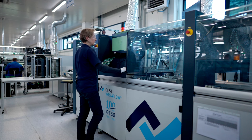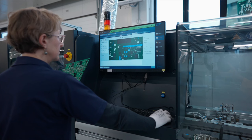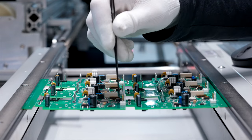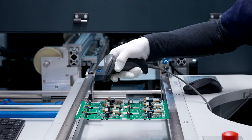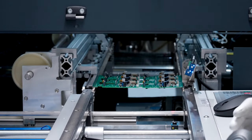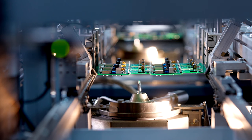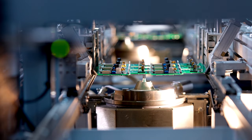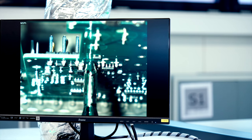As the next step, we utilize through-hole technology for larger and more complicated components. The component is mounted into the board and then the board is scanned before entering into a conveyor. Inside the machine, there's a computer-controlled soldering system with multiple irons and variable nozzles that precisely applies solder to the components' soldering points.